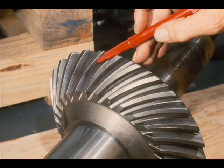The teeth of the gears are very important. Watch closely for signs of pitting, wear, or corrosion, and learn to recognize each type of wear or damage and the reason for it. Since these gears are in satisfactory condition, we will use graphic illustrations to show you what to watch for.